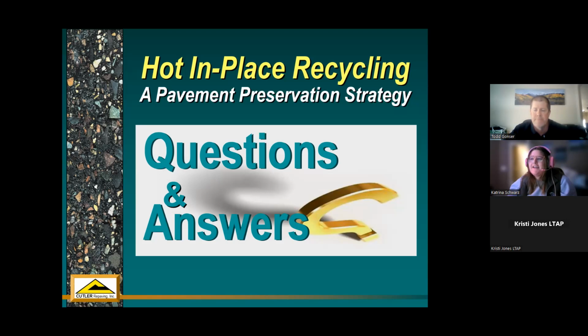Awesome. And then the second question says, if you know that the asphalt that was installed was faulty, would this process be beneficial? Yeah, I think anywhere, if it's in that top lift, so like the last paving operation that went through there 12 or 15 years ago, if you know that your defects are mostly contained to that top lift, in other words, minor rutting, oxidation, minimal thermal transverse cracking, that sort of thing. As long as you know it's confined in that top lift, absolutely, this is the process that you can use to attack that. Anything that's deeper, heavy fatigue cracking, alligatoring, base failure, subgrade failure, that sort of thing, that's deeper. You need something different. So if it's in the surface, any of the in-place recycling treatments are a good option.